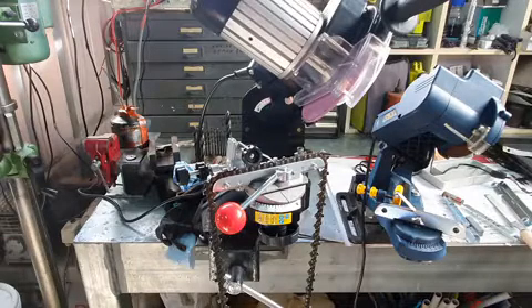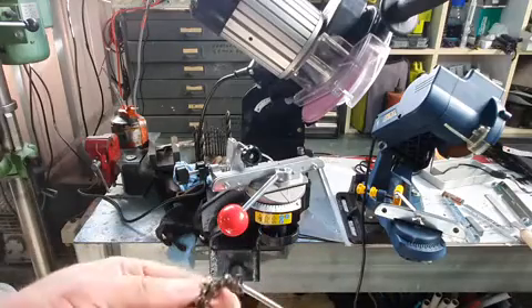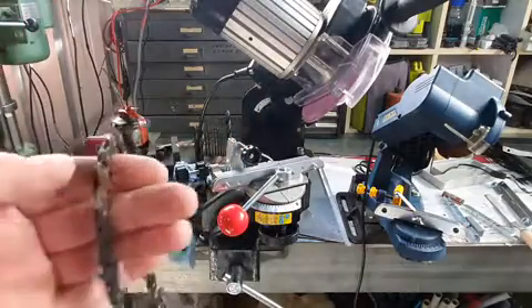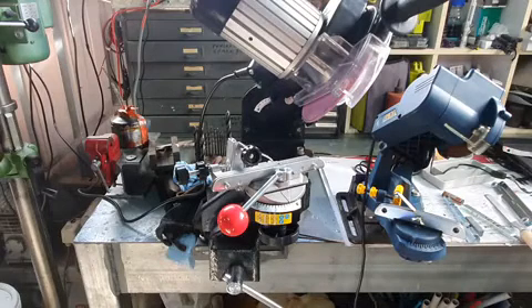One final point: whether you're using a file or any type of grinder, don't use excessive pressure. Always go light first, apply light pressure, then inspect the tooth. Before sharpening any chain, take it off the chainsaw, inspect all the teeth for damage, and that will give you a good idea of how aggressive or light you need to be with the grinder or file. I hope this video helps - there's a lot of information out there about sharpening chains, but when I first started I was looking for exactly this kind of guidance. Thanks for watching.